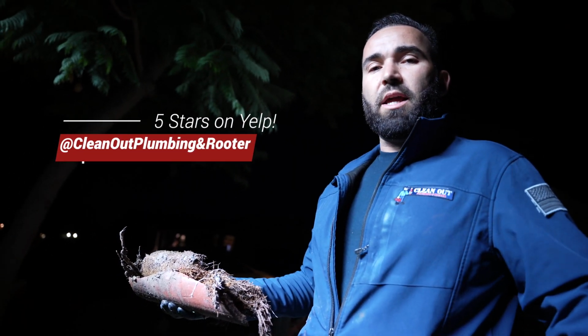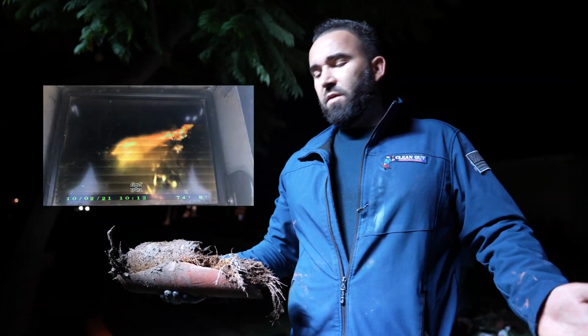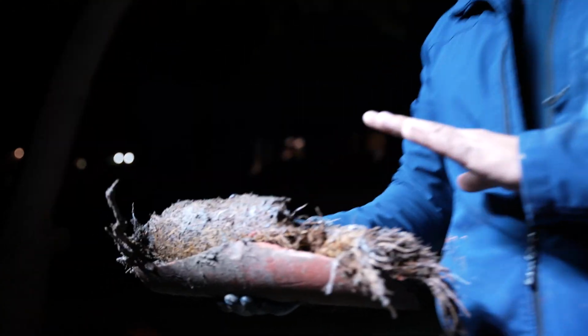We ran the cable, we got the line cleared for them, $49. We were able to offer them a free camera inspection to see exactly what the blockage was. We found roots in every single joint, compaction, all the way out to the street.